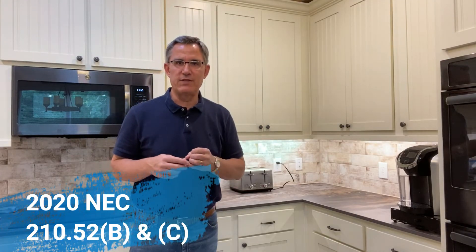There are some rules that people fight with and they come up occasionally on inspection because somebody has forgotten some of these basic rules. The National Electric Code says the kitchen outlets shall be served by a minimum of two circuits, which means you'll have two breakers on your panel for kitchen countertop outlets. So they shall be ground fault circuit interrupter protected — GFCI protected.